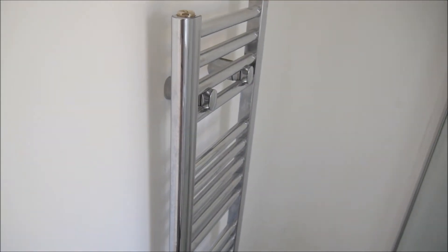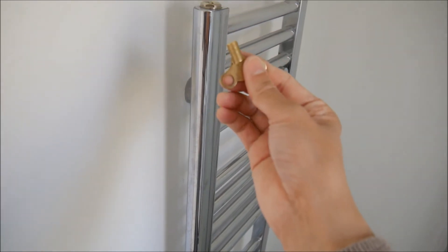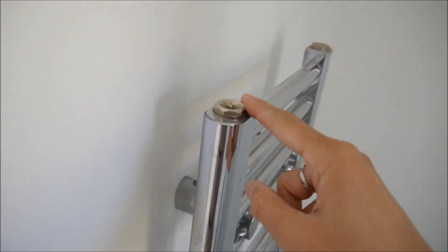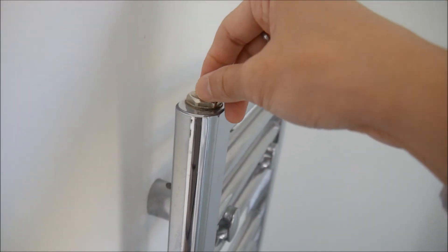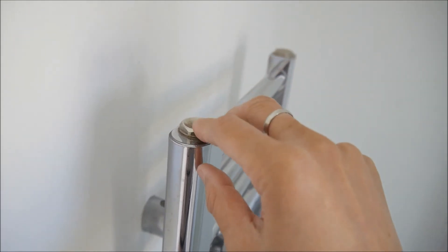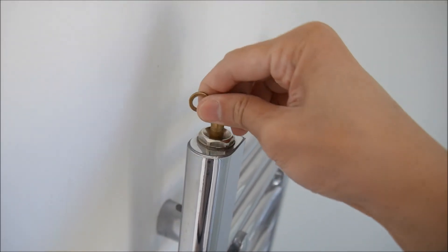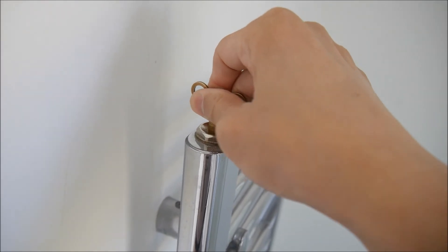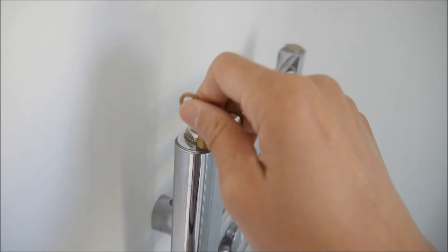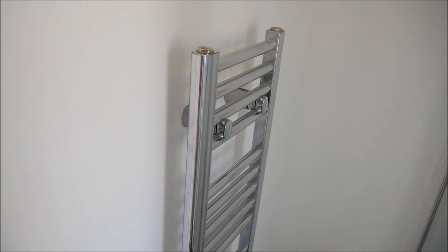So what you can do is to turn on the boiler again to heat it up and see if it has improved, then you can release the air again and do the same thing, until the water comes out. You may see some people keep the boiler on while releasing the air - I can say it is not dangerous, but just beware of the hot water. If you are doing this for the first time, I recommend you to release the air until no more noise, then turn the boiler on again, and repeat until water comes out.